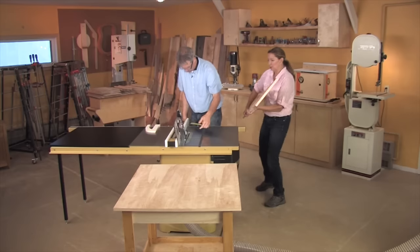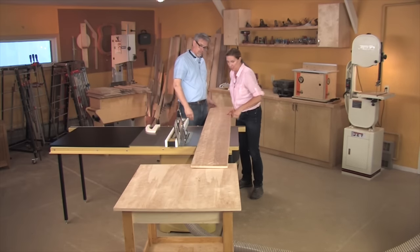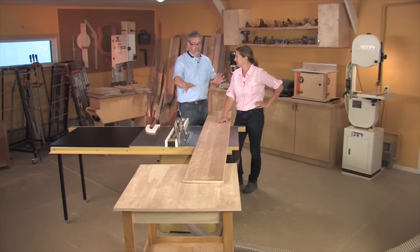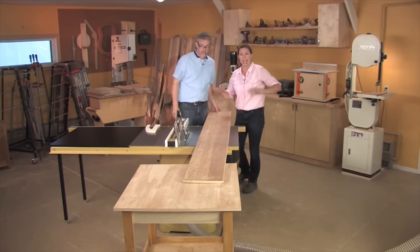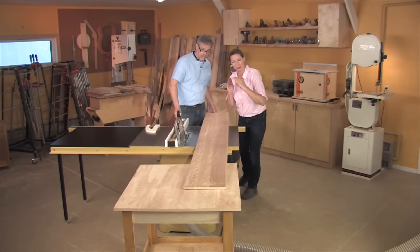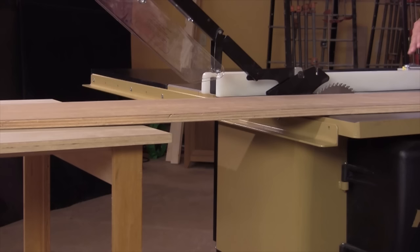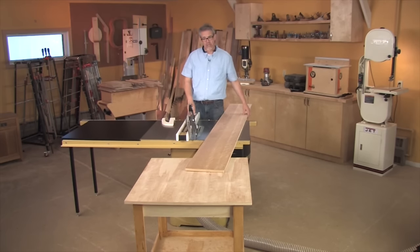It is one thing to cut super slender pieces and quite another to cut pieces that are super long. We have to cut stock like this eight-foot piece of plywood all the time. In an ideal world there would be someone in your shop ready, willing, and able to catch the falling end — sometimes called the dumb end. But this is really all about the outfeed table. Outfeed tables are super useful and work similarly to an outfeed stand, supporting the wood as it comes off the table saw.